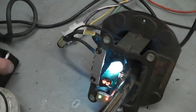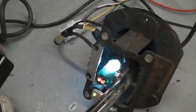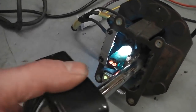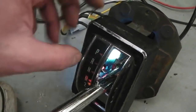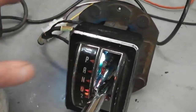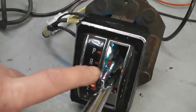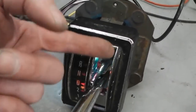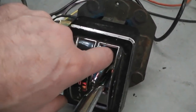The lights will probably dazzle you. Just at the edge there, there's a little roller micro switch which works better. We've got to build a couple little lighting shields for this, and also we've got to build the bristles or the rubber slit which hides the internal workings. They're always aged, and you find them and they're always cracked and perished. So we could get a draft excluder brush edge and make one of those bristle type enclosures. They're much better. With me increasing the light in here, we're going to get some light bleed through.